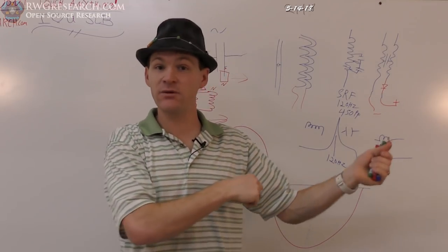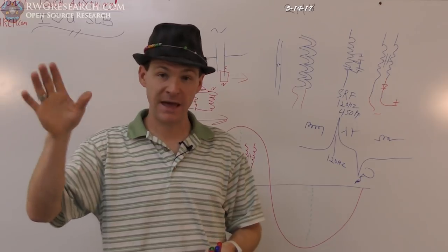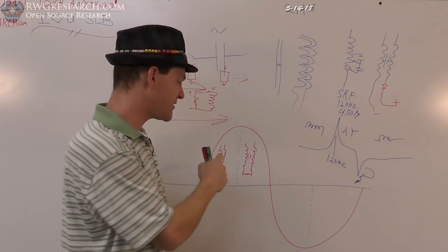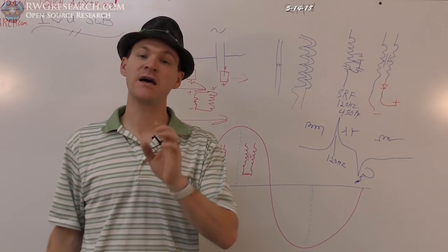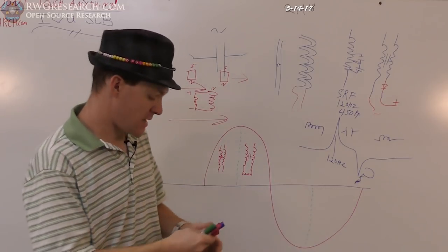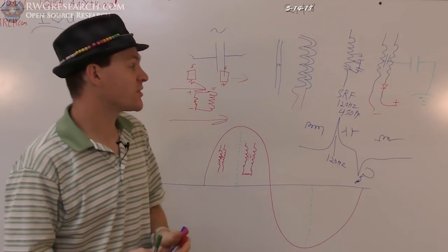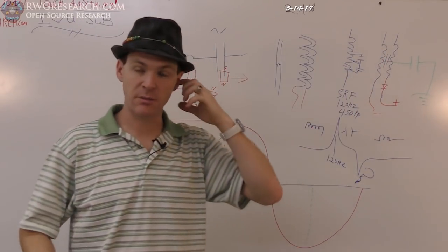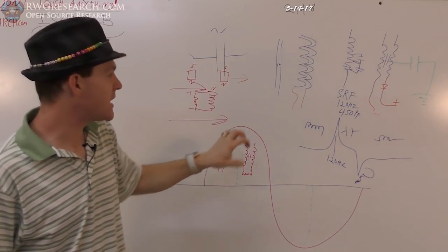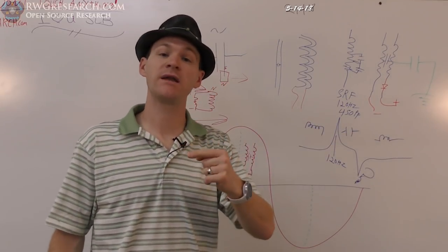While it's charging it generates a magnetic field, but once done charging it will hold the charge for a certain amount of time then decline — there must be a lot of internal resistance. I can charge the coil like a capacitor, take the batteries off, then discharge the coil across itself and generate rotation. This means I can achieve this goal if timed right. Unfortunately this coil was designed for high-frequency RF coupling, not this exact scenario.